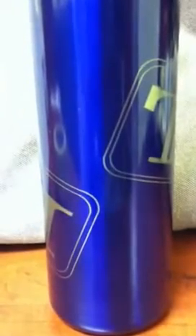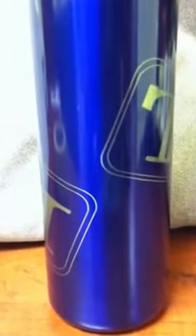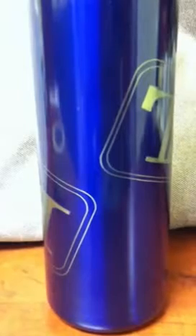There was some concern that I might have just been lucky that the scaling worked out — that's not correct, it works quite well. My current setting on the controller is for an 18mm diameter object, and all I did is swap out the 18mm diameter object. I just put in this bottle, which happens to be 70mm. And as you can see, everything works just fine. It's not a matter of scaling when you are using the friction feed rotary adapter as I am.